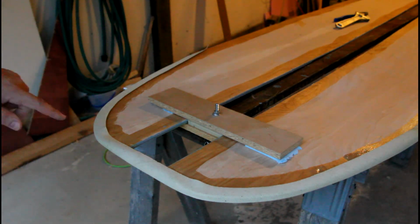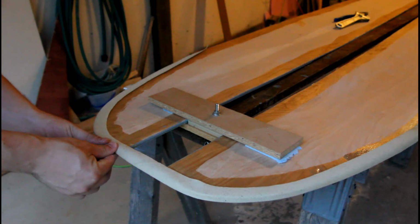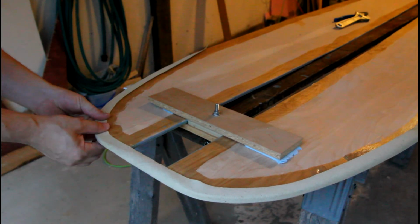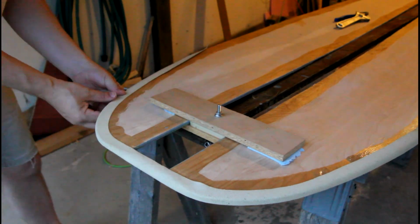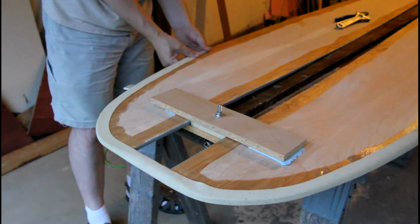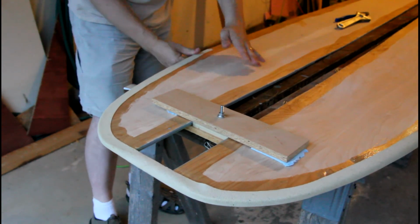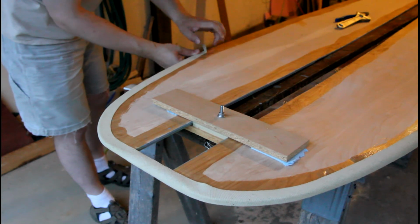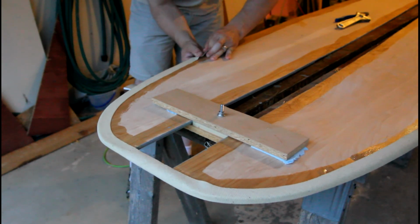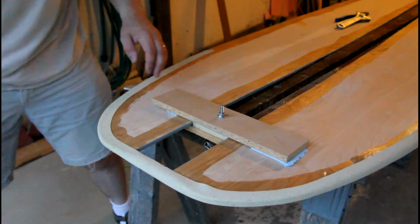Okay. Now, you see there's a little pucker here. We want to try and push near the pucker, but not on the pucker itself. If you push on the pucker, you end up making two folds right beside where the pucker and your finger went. Okay, if you're very careful, you can peel this back up when it's just stuck. You cannot do this the next day, but if you just stuck it, you can usually peel it back up some.